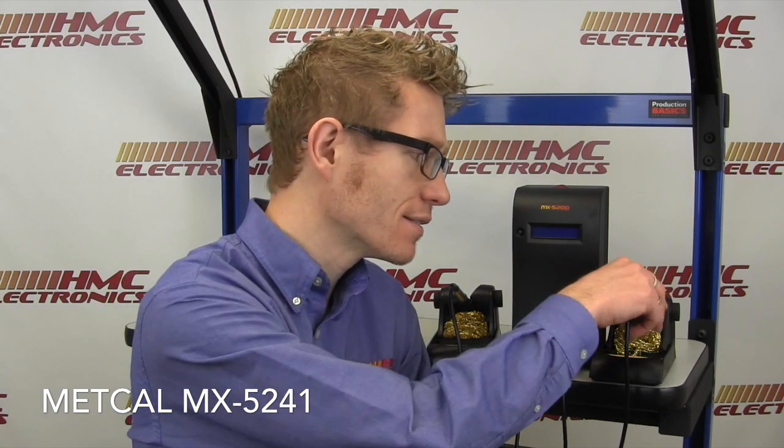Now on to the precision tweezers. You may have used in the past the Metcal Talon, the MX Talon with its TAT series tips. Metcal did a great upgrade on what was already a great handpiece when they did the precision tweezers. Really, really small grip, very compact design. They have a little locking switch here, so you can either have the full range of motion, or if you're working on something very small like an 0201 device, simply push that tweezer grip up and it will limit how far that tweezer action will actually open. So you're doing a very, very small movement.